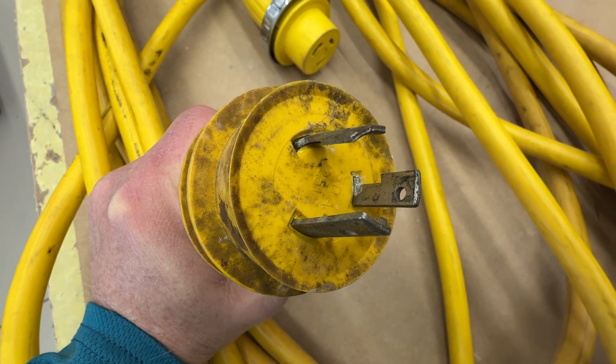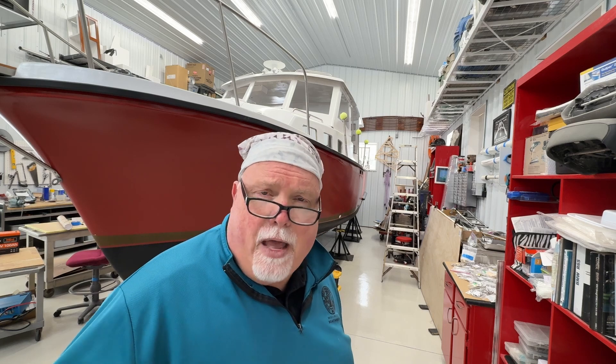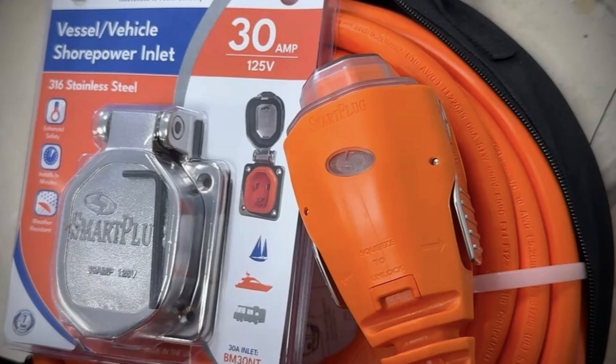The number one cause of fires on a boat is a shore power failure or some sort of overloaded circuit. When you start looking at the equipment used to attach shore power to a boat, you realize how prone to failure some of these components might be, especially if they're older. On most boats, the shore power connector is just one of these yellow plug-in jobbers that twist to lock in place — you've probably seen them at yard sales. These things have a finite lifespan and frankly they're not that well built to begin with.